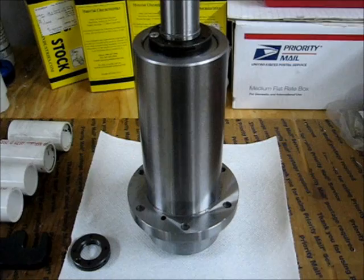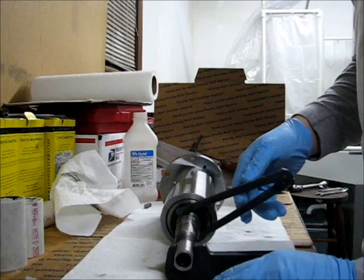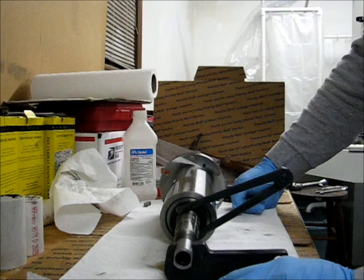So I just completed adjusting the torque on the stack nut on the spindle here. It was running a little warm. I was idling it, I guess is a good term for it, because it wasn't cutting anything, but it was not spinning at slow RPM. It was spinning about 2,500 RPM. I let it run for about 10 minutes. The temperature settled into probably 110 degrees as measured by sticking a tool in the nose.